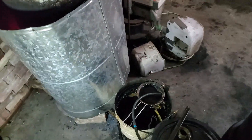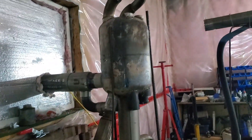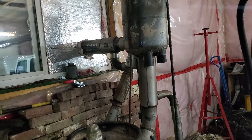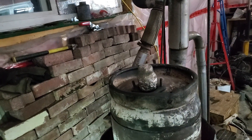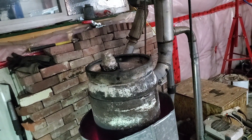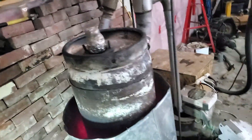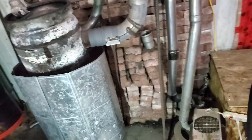When it gets hot, convection actually makes oil come up the pipe and out, so I get a little squirting going on in there. You can see how hot this barrel is — it sips on oil all day long. I usually use about a five-gallon pail of oil. I found that preheating the air that goes into the oil burner unit actually helps the burn and I can pull the forced air volume down quite a bit, getting the flame all the way down to a tiny burn so I can regulate the heat.